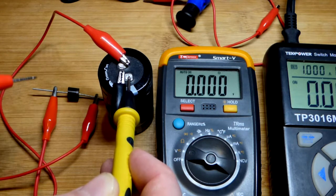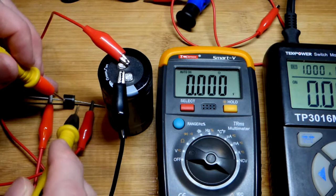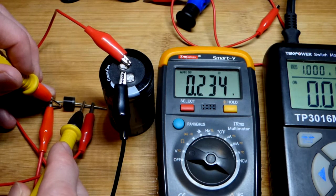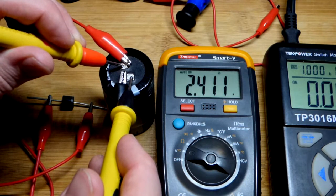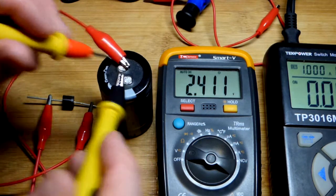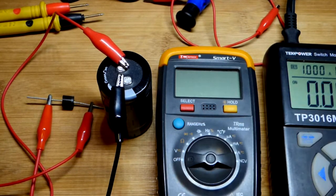I'll probably address that problem in the next video. Looking at the voltage at the Schottky diode, it's about 0.234 volts. Since we're going to 2.7, that's 2.4 on the supply side, and the capacitor is just a little shy of 2.3. So we're probably actually not doing too bad. This didn't go nearly as smoothly as I had hoped, but it gave me ideas for future videos and I'll try to make a better capacitor charging video where I do it more appropriately.